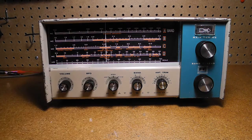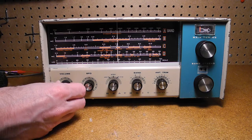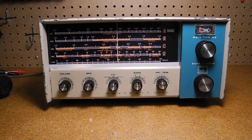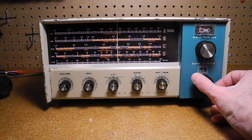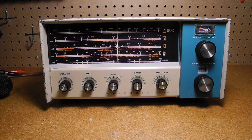Here I am listening to an amateur radio station transmitting in Morse code. For CW or single sideband reception, you turn to CW mode, which turns off the automatic gain control. Then turn up the BFO and adjust both the BFO and tuning — usually band spread — for the best signal. Tuning of CW and single sideband signals is quite tedious as there's interaction between the BFO and band spread controls.